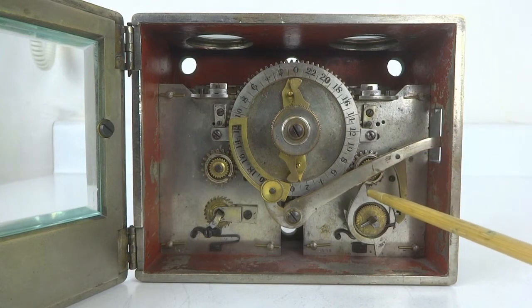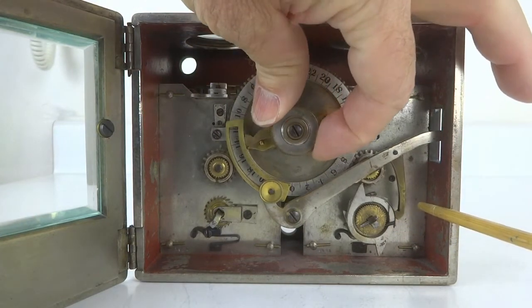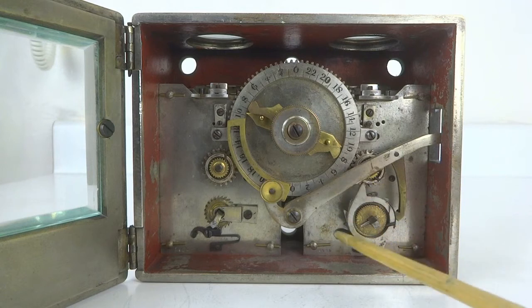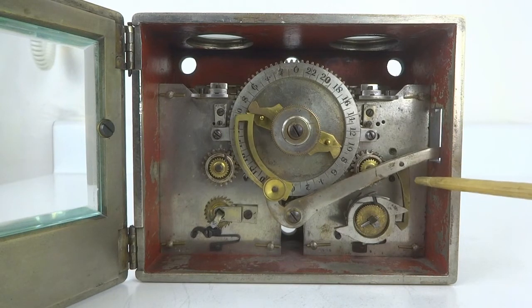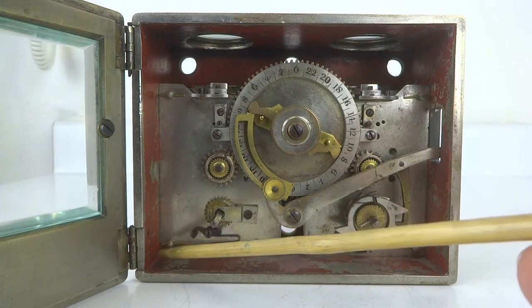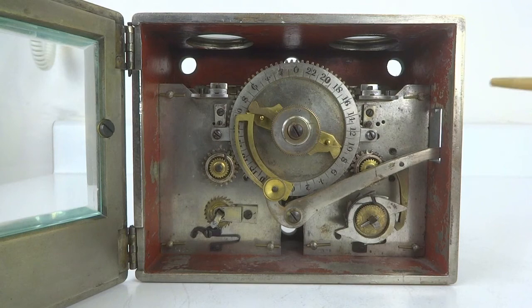Now, at the point that this has been activated, it can no longer fall down again once the wiper has passed this sector. So it is now permanently in an off guard position and cannot be put back on guard until the operator manually comes in and again winds the time lock. This problem of the arm sometimes being unreliable as far as falling was later corrected when Mosler bought the Beard company a couple of years later and put over here a spring assist piston which pulled this downward to make sure that there was positive locking action on it.